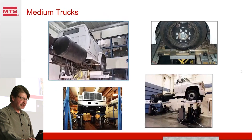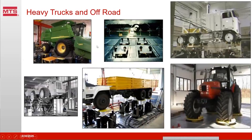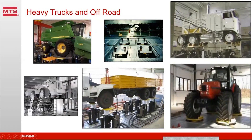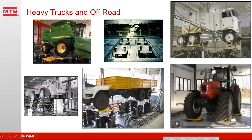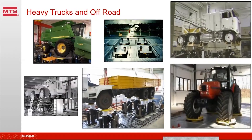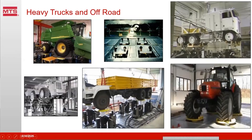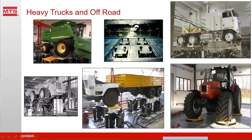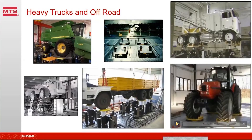Here are some examples for medium trucks — you see a delivery tractor, heavy trucks, and off-road vehicles. We've got up to an 80-ton vehicle with a grain bin on it, and various heavy trucks. The tractor testing is primarily for ride comfort studies. The governments in Europe have determined that the tractor seat is a workstation and therefore it has to meet workstation comfort rules and must be certified that way. So there are various four-posters in Europe specifically used for ride comfort evaluation of tractors.